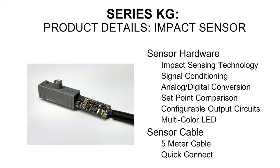It measures the impact force, and then will relay that information to you. You can use a PLC to interpret the sensor's data, so in case of erratic operation, the whole system can be shut down to prevent catastrophic failure. The sensor features single-axis, bi-directional sensitivity.